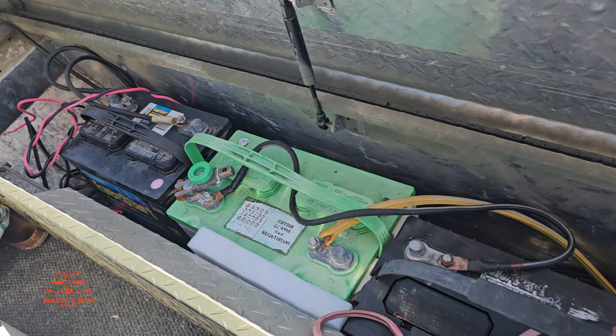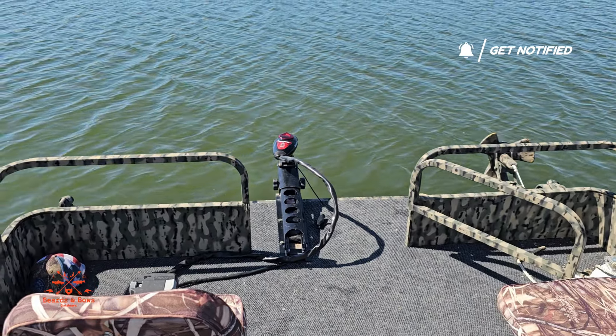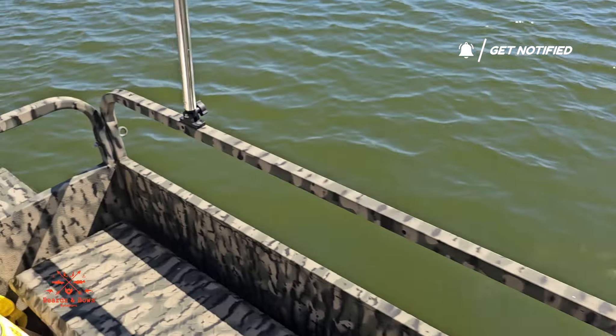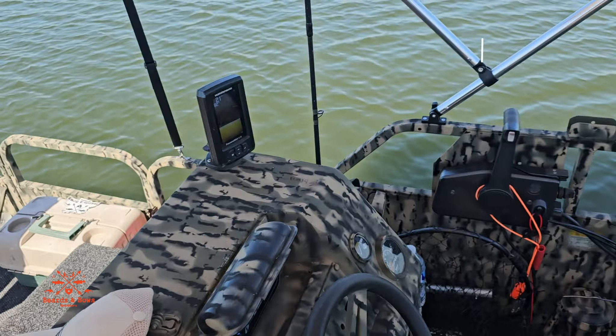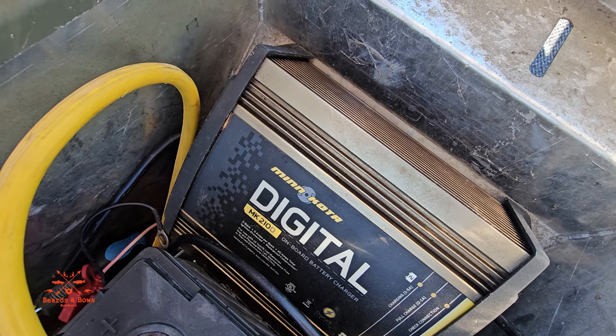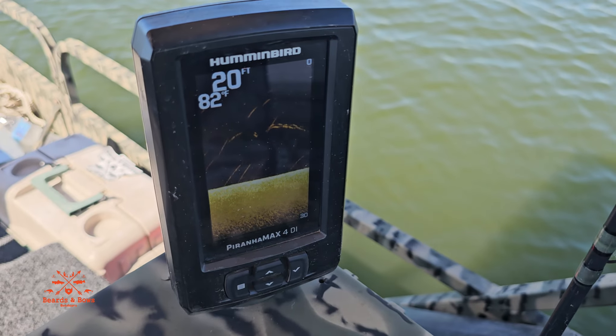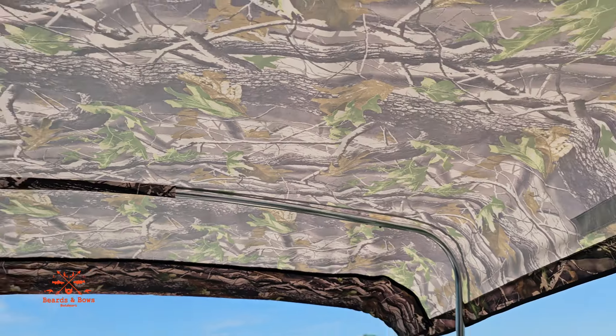This is my battery storage area — two batteries for the 24-volt 60-pound thrust trolling motor, one battery for the crank, and then I got a battery under here for the radio and fish finders. I have the MinnKota Digital MK210D — it charges two batteries at once. This is the Humminbird Piranha Max 4DI; this will get upgraded eventually.